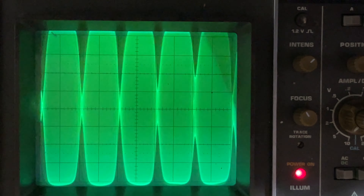I'm trying all different levels on the two-tone just to see what happens — but yeah, that's good. The only thing I need to do now is an SSB test just to confirm that everything is good on air, but it should be because it looks absolutely correct. So there's FM at 4 watts roughly, and onto sideband just over 11 watts — perfectly acceptable and perfectly normal for this transceiver.